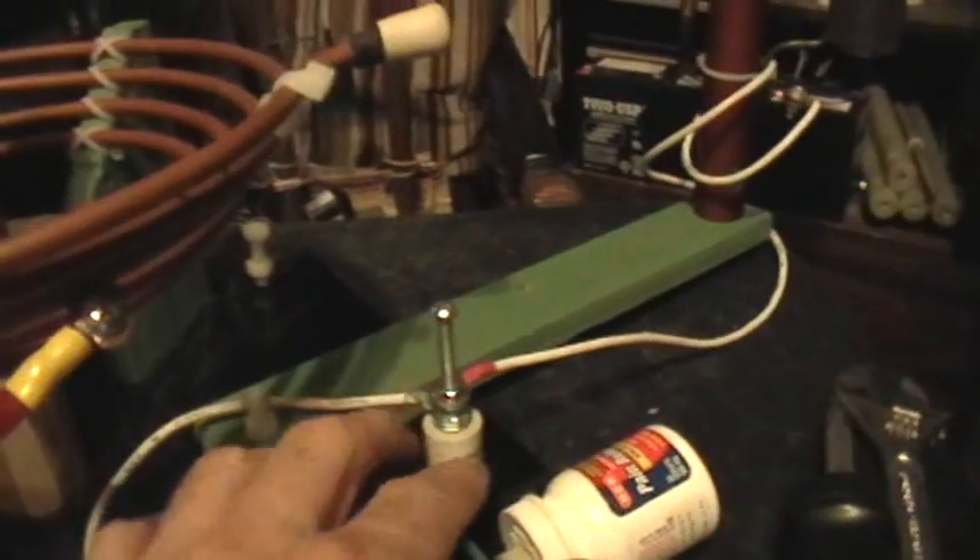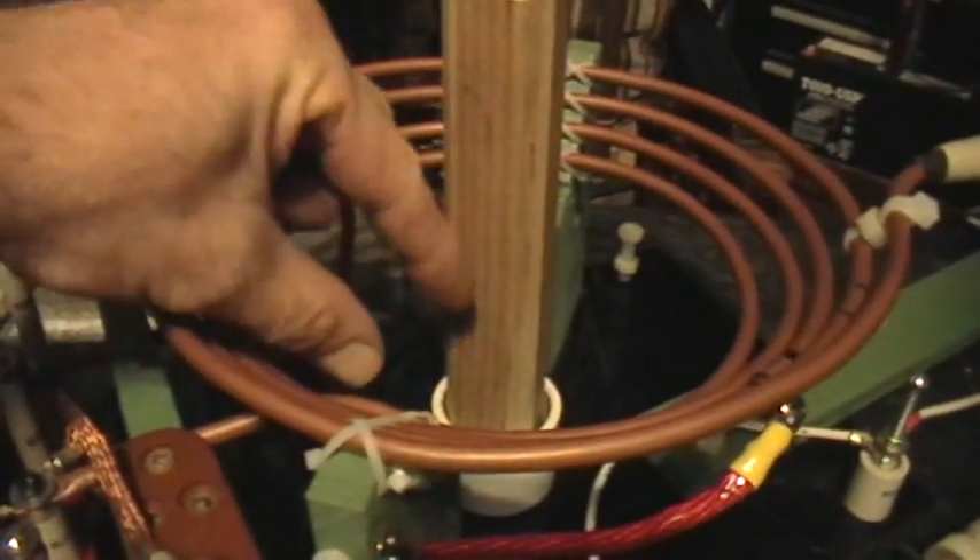The wiring and mounting connect it to the board's ground terminal there. I used a PVC spacer there, and this helps to adjust the coupling coefficient between the coil primary and the coil secondary, by allowing you to vary the height of the secondary and the spacing between the turns of the primary and secondary.